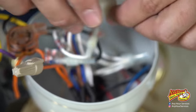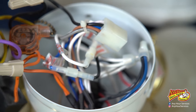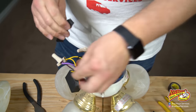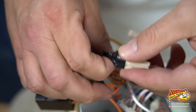If you don't have wire nuts, you can look in here and see that when they manufacture it, they use crimp connections. Wire nuts are easy to get a hold of. If you want to be safe and it makes you feel better, you could actually take some electrical tape — just take a little piece and wrap it around the edge of the wire nut and the wires.